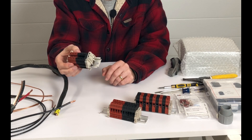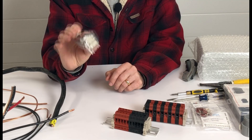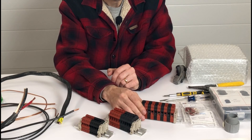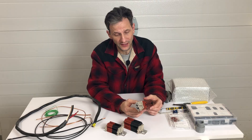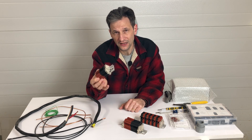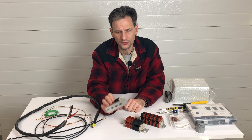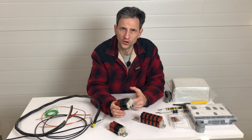The DK4N is good for 600 volts and 30 amps, handling wire sizes from 22 gauge all the way up to 10 gauge, both stranded and solid. The DK6N is good for 600 volts, 50 amps, wire sizes from 20 gauge all the way to 8 gauge. The DK10N is good for 600 volts and 60 amps, wire sizes from 20 gauge all the way to 6 gauge. I contacted International Connector and talked to Clayton, and he recommends using one size up from your largest wire — so if the largest wire in your system is 10 gauge, he would recommend going up to the DK6N size, because that's the DK4N's absolute maximum, and it's a little more convenient to manage with a slightly oversized connector.